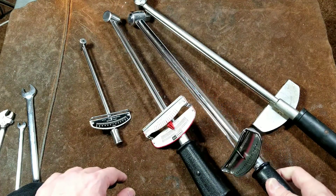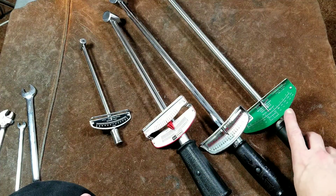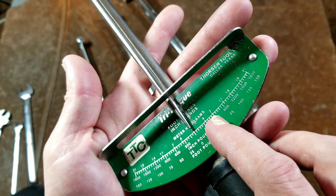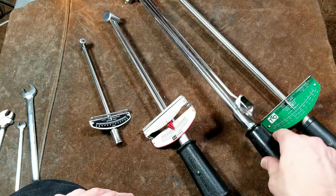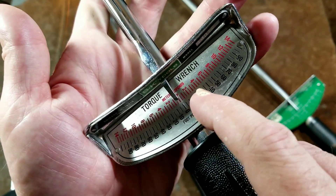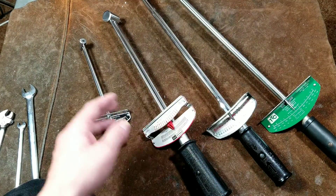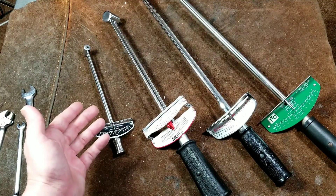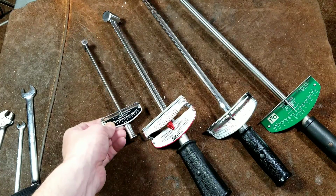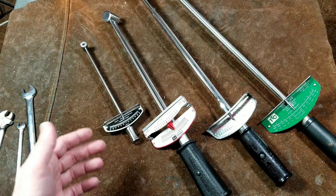Anyway, that was the end of this quick review and comparison, just showing different styles of deflecting beam torque wrenches and some different features. One last thing: if you get one with a wide range like this Thorsen at 150 foot-pounds, each tick mark represents five foot-pounds of force, which can be a little hard to read. That's what's nice about one that goes to just 100 foot-pounds — the tick marks are still five foot-pounds but there's more space, so it's much easier to hit right on the number. For small values, I actually use the quarter inch the most, particularly for bicycles and other small items. It's the end of another Cadus Maximus video — I really appreciate everybody watching, please subscribe.